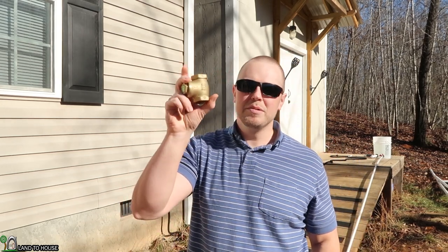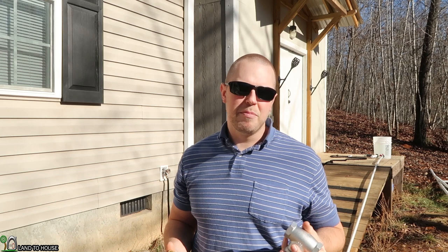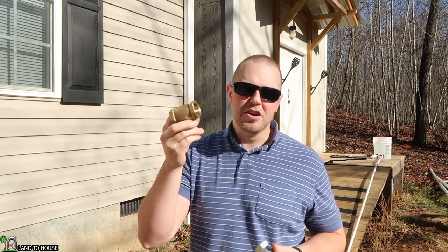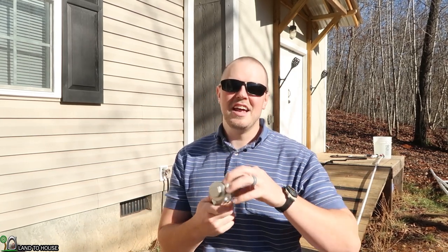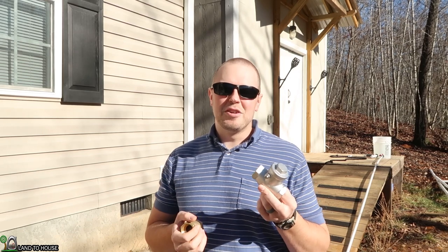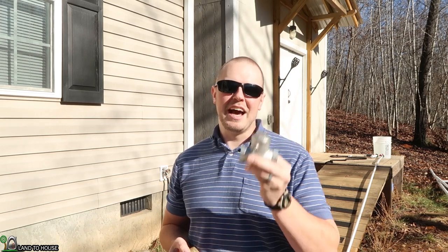I've got some really exciting news coming up for 2020. I'm converting all brass valves to stainless steel. From my experience, with about a seven-foot head pressure, a brass valve will last about one to one and a half years before it starts to wear out. In a typical year, a Ram Pump will cycle about 31 million times — that's a lot of movement for a brass valve. I tested a stainless steel valve for five months and saw no signs of wear, not even discoloration. I anticipate the stainless steel valve is going to last five years or more.